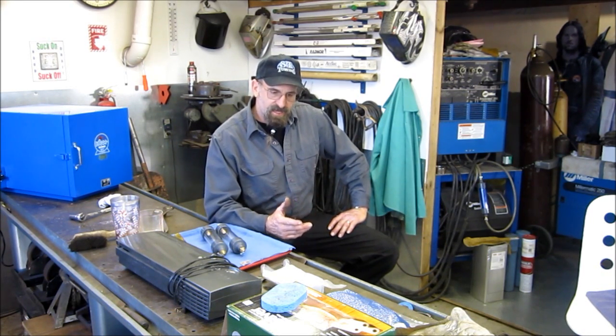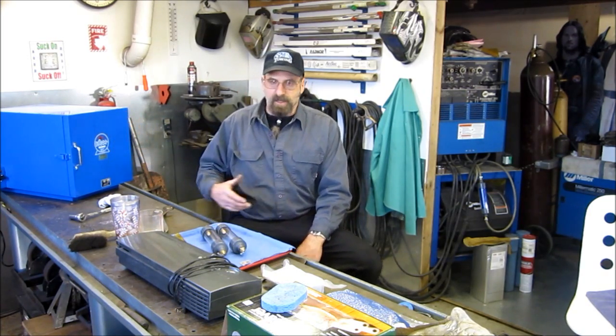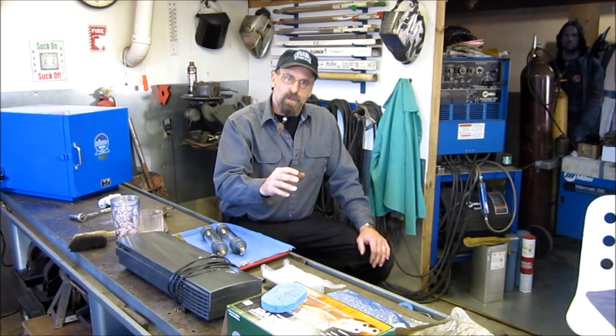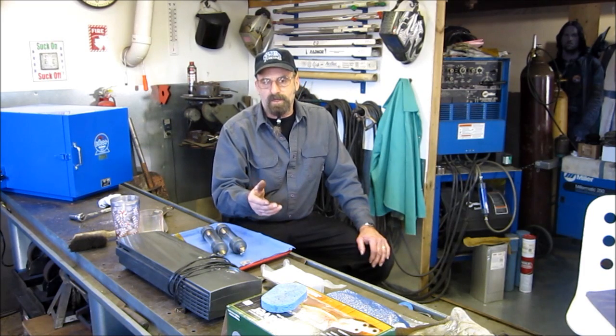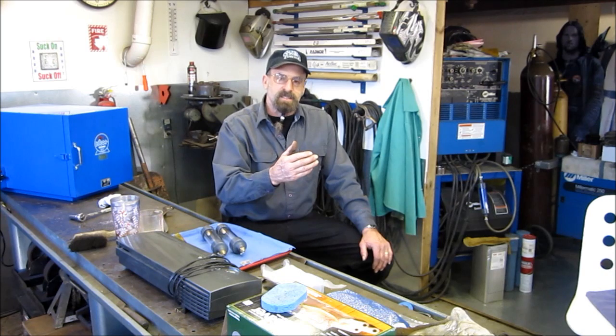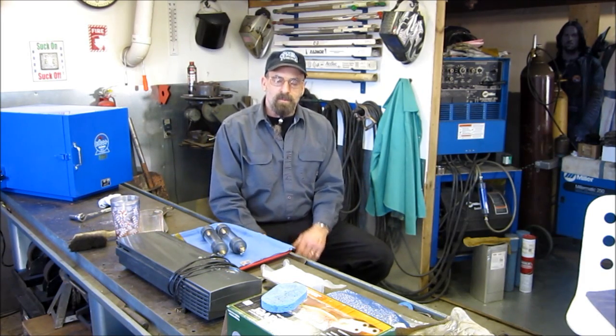Let's just kind of put together what we actually learned over the weekend. We can rejuvenate our desiccant — bring it back to life and reuse it — so we don't have to buy new desiccant every time. We also know that my rod oven that never gets used is good for something. We did a slow cook of 225 degrees for about six hours on Saturday, and we were able to cure the batch we put back into the canister. We're going to see if that works as well as it did brand new, and how long the duration is before it turns mauve again.